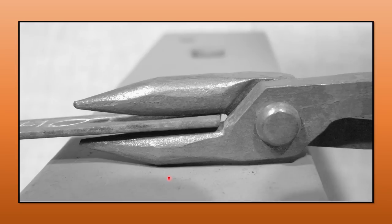The jaws can have a variety of gaps — anything from a quarter of an inch down to a sixteenth of an inch, depending on what they're intended to do. If you're holding scrolling material on a scrolling jig you might want something a little larger, say an eighth to three-sixteenths of an inch. If you're dealing with something like a rose then you want something that actually touches or has maybe a sixteenth of an inch gap. Make sure you're forging the gap to your intended outcome. Perhaps the most important thing to note is that I've written HOT on the spacer bar — that bar is about three or four inches long and gets hot quite quickly as you're adjusting the jaws.